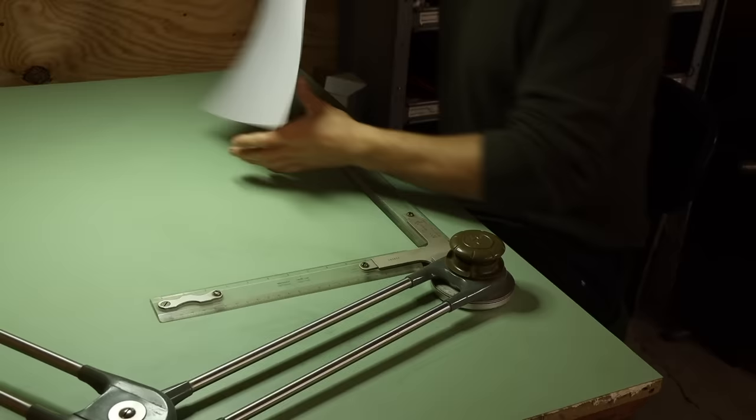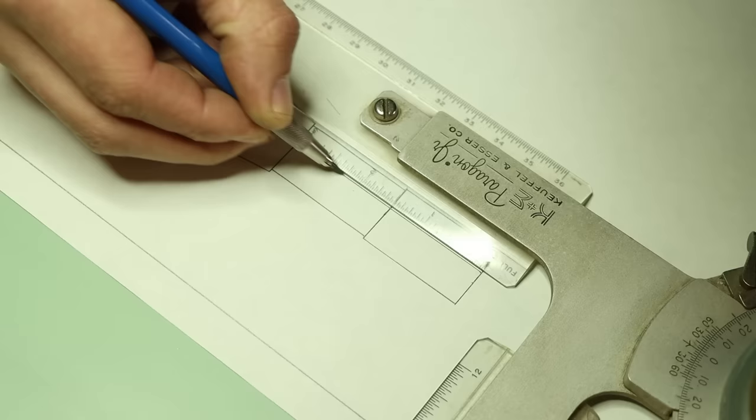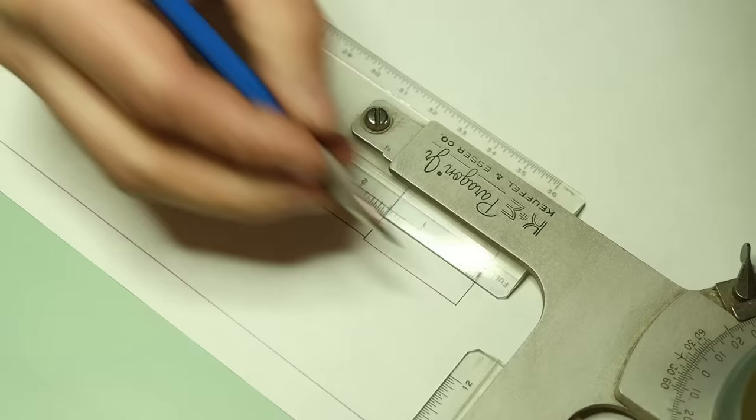I'll give the original designer credit for one good decision. They included an R8 taper, as opposed to just a straight shank one would have to mount on a collet or other adapter. Mounting straight from an R8 is the best option for maximizing rigidity and minimizing runout, so I will be copying this on my version.